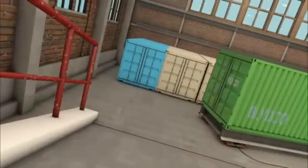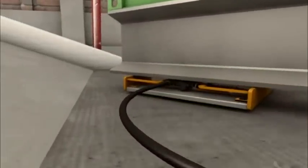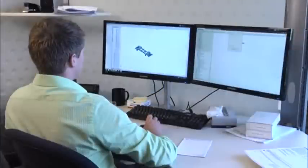Flatness is also a factor. Upward grades and steps can be a limiting surface for air-bearing movement. Airfloat engineering support can help you decide if the surfaces in your facility are suitable for Airfloat products.